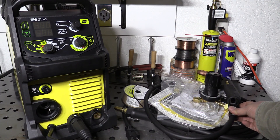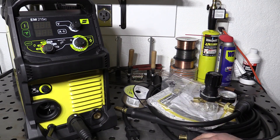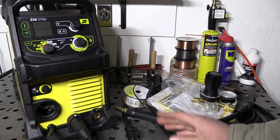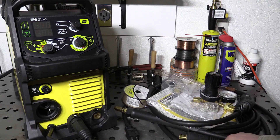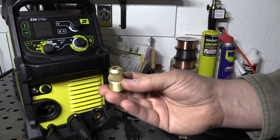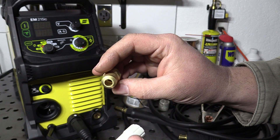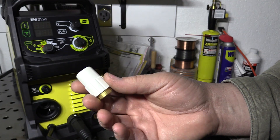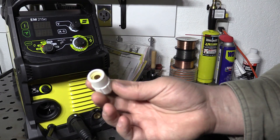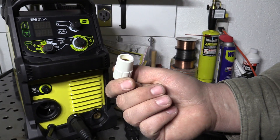This MIG gun did come with a note that it has a 0.030/0.035 liner size installed, and it says for best results with 0.025 wire they recommend installing a different liner. I do have some 0.025 wire I'm going to be running for testing and I'm just going to use the included liner and see how it does. Also, here's the flux core nozzle that I picked up for the machine — it doesn't come with it, but I bought it locally. This is the metal part that screws onto the end of the gun to hold the contact tip in place, and it comes with an insulator that threads on around it. Unfortunately they do come two to a pack and they're not super cheap, so again it would have been nice if it came with one of these.